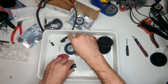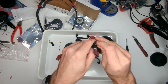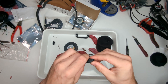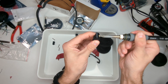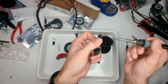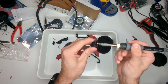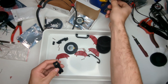Repeat for the other three thread mounts. We've got two thread mounts, four holes total that need those brass inserts. Make sure you put the wide part of the brass insert at the top. You can push them in place to start them out, and if you need it, put that screw in as a guide. These should also go in nicely on their own — just hold it sideways and gently push, let the heat do the work. Only go until it's flush with the surface. I set my soldering iron to 350 Celsius, which seems to be a good enough temperature. It just needs to be enough to melt the plastic a little bit.